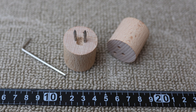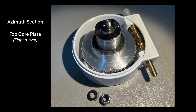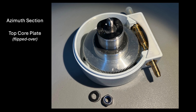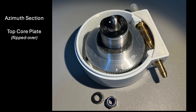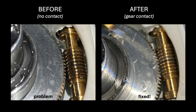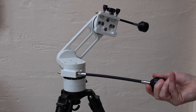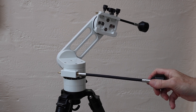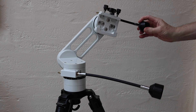If you recall from the previous video, when you remove the cover plates of the drive cores — as you see here, this specifically is the azimuth unit — the main rotational drive is a large circular gear support that is incrementally turned by a brass worm gear device located adjacent to it, such that the teeth of each of these gears are interconnected. The manual rotation of the brass worm gear provides a force to slowly spin the large circular gear and hence move the telescope left or right for the azimuth mechanism, and up or down for the altitude mechanism.